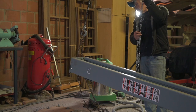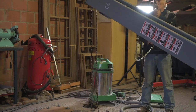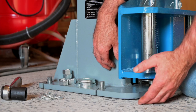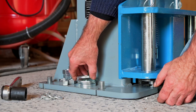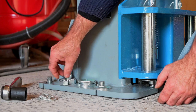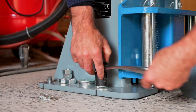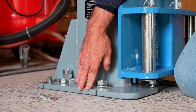I'm using a pulley to lift up the first column and turn it the way it has to be. We've lowered the pillar and now we can tighten them down to the ground. But don't tighten it all the way because you may have to adjust the level of the pillar — so we're going to use a big washer, a big locking ring, and then the nuts. Lock it down a little bit in the beginning but not too much so the pillar doesn't fall over.